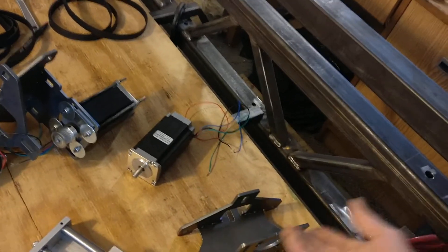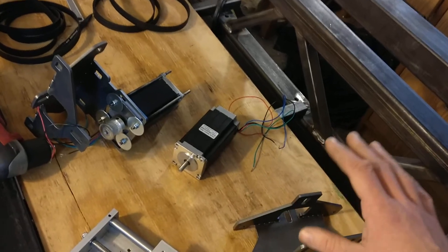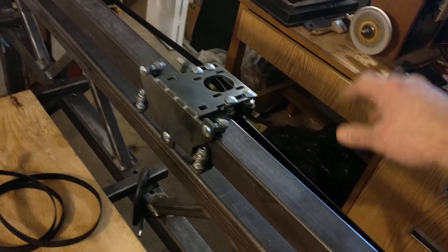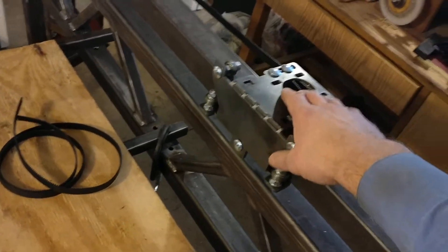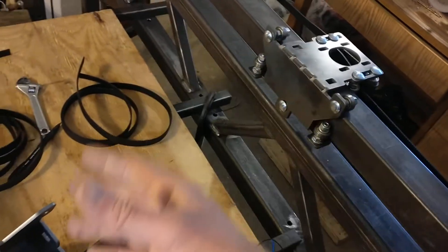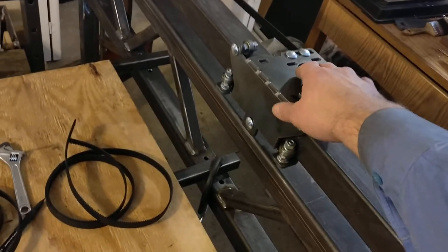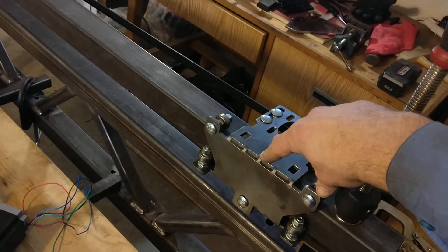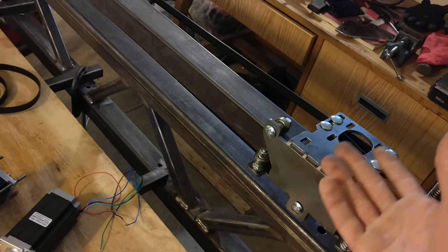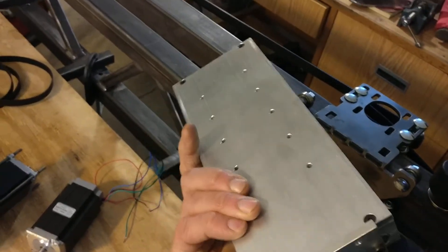I'm happy it saved me the work, but if he actually cared he would advertise the right thing and make more sales. Anyway, these rollers are designed to roll along a piece of structural steel tubing. As I discussed in the other build video, this belt routing isn't really right but it's enough for demonstration purposes. You can see how the roller would transfer any irregularities in the tube and the imprecise fit from these bearings to your work piece — so it's not the most accurate solution, but it'll be good enough for starters. You'll also lose about three and a half inches of travel at either end of the axis from where the carriage roller hits the end of travel. Additionally, you'll have to either shim your Z axis off away from the carriage bolt or make a clearance hole on the back so it'll fit flat.